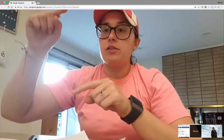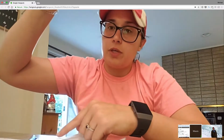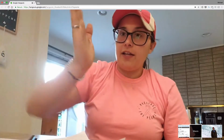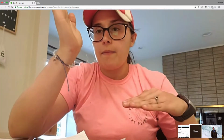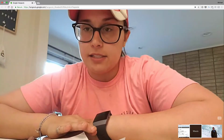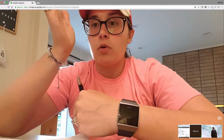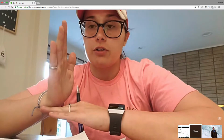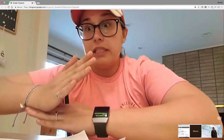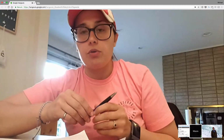That's fine. So the kingpin angle in a control arm suspension, you have your upper and your lower point. When you draw a line between those two points to the ground, it's going to either be straight up and down or it's going to be tilted, changing the angle. Where that line crosses the contact patch of the tire is called your scrub radius. That's important for you because you're not allowed to have a power steering system. So the more centered your scrub radius is, the easier it is for the driver to turn the wheel. However, there are benefits of being slightly off-center or really off-center in terms of vehicle dynamics performance. So that's something to look into and consider as you go through it.